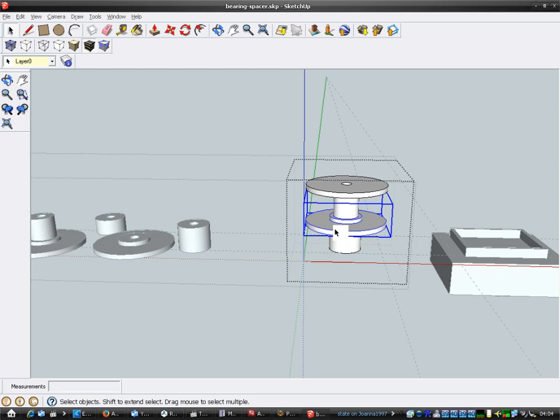Well, my spacers actually are supposed to be 1.5 millimeters thick. Actually, not far off. It actually measures 1.93 millimeters. It's supposed to be 1.5. I actually ordered a new nozzle as well, a 0.2 millimeter nozzle. Yeah, I'll have to sand that down a bit, I think.